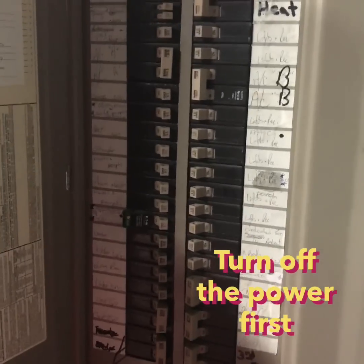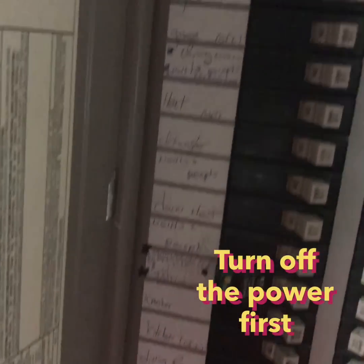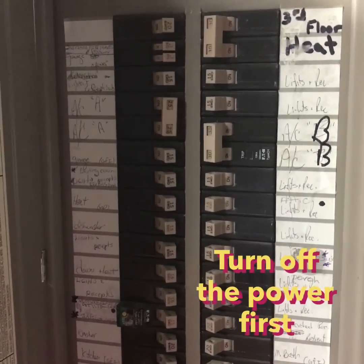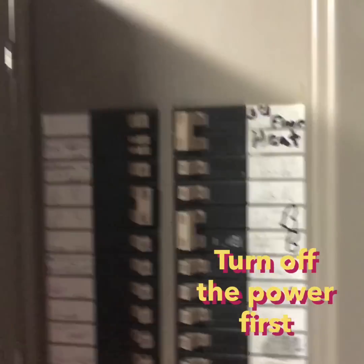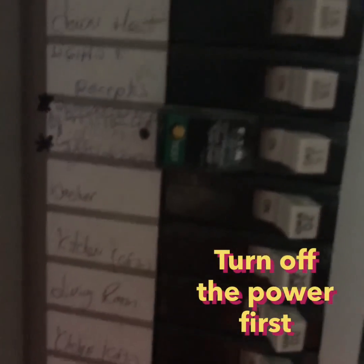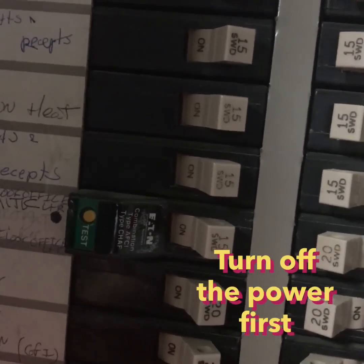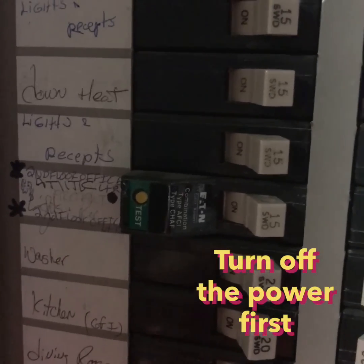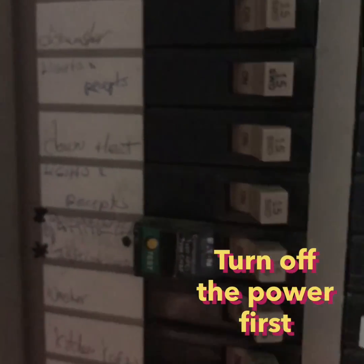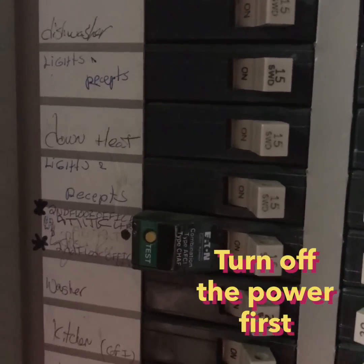Here I am in the garage looking at all the circuit breakers. My house was built 19 years ago and none of the labels put on by various electricians say 'smoke detectors' because it was one of the first things wired in. You'll have to go through each one individually, but here's a clue: one of your circuit breakers might have a test switch on it — this is called an AFCI. It's most likely that if you have one of these, this is where your smoke detectors are. Just flip the switch and go upstairs to retest.